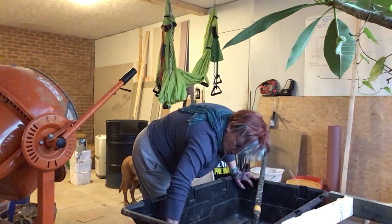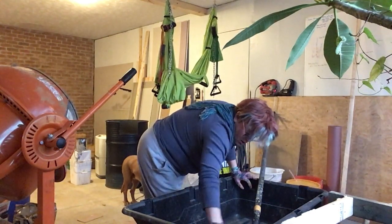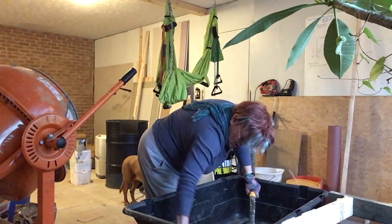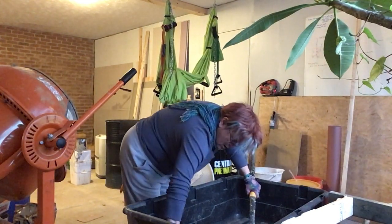For really simple passive systems, you can put that tank somewhere way downstream. Like in my case, with the tiny stove, I think a great place for a tank is the bottom oven chamber, because it'll never really get much above 250, so you almost don't have to ever worry about it boiling.